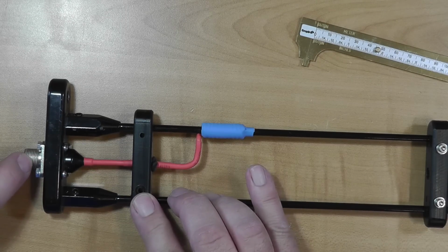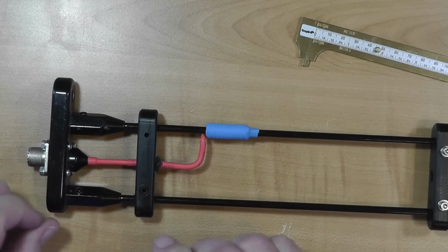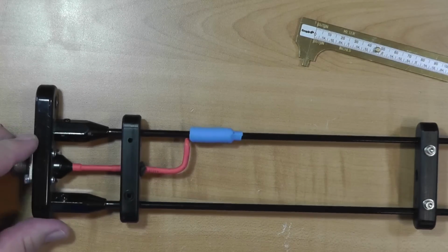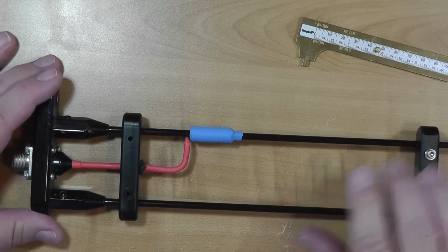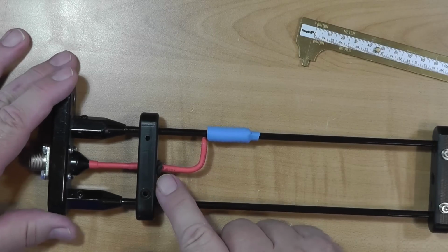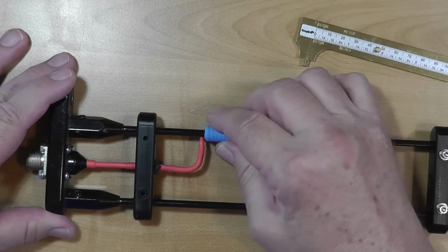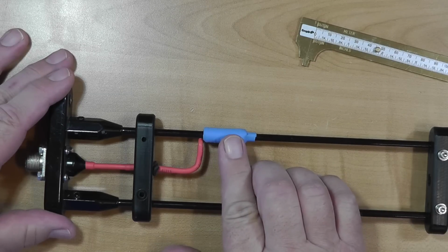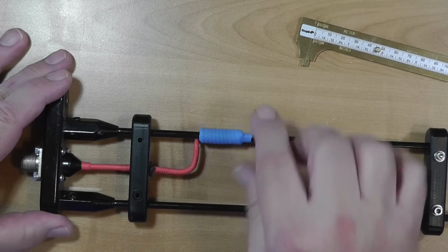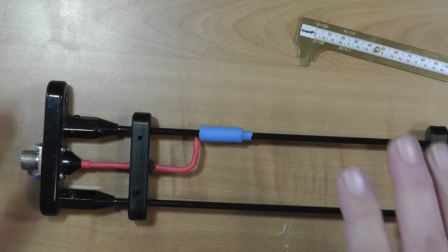We're putting the shield with the bottom here, and it is physically connected to the two wires. These are stainless steel, by the way, heat treated to bend a little more easily. And then the center conductor, and you can see the quality of the workmanship here, comes up over here where it is wound around the antenna without touching it. He says this is inductive coupling, although I would say it's capacitive as well because it's so close. In any event, we're going to put this thing up and see how well it goes.